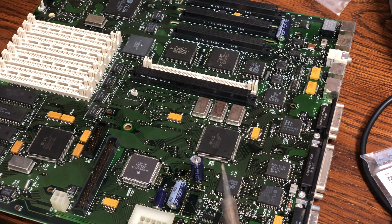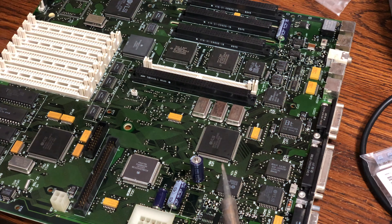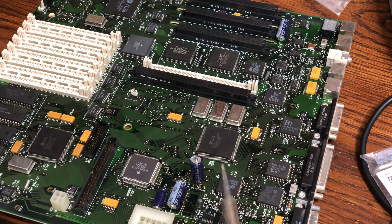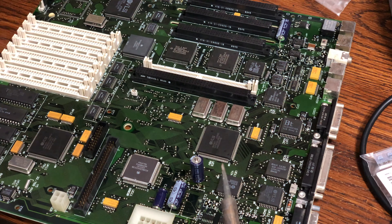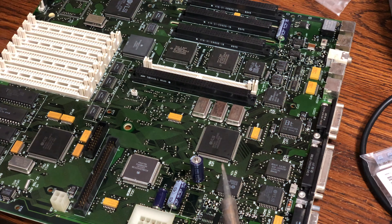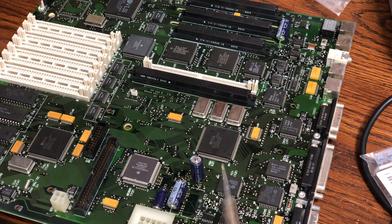I'm not going after the RAM slots — there's no capacitors near the RAM, which is probably a really lucky thing. I'm going to add some soap now — putting a lot on actually. There's plenty of water on there so this should suds up nicely. I think a lot of the reason why these don't work after people get done is there's still acid underneath, which is sure to be pretty conductive.